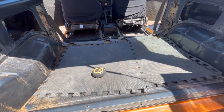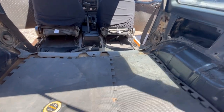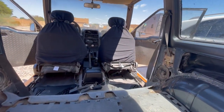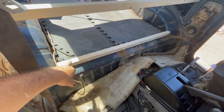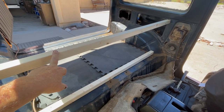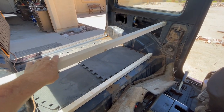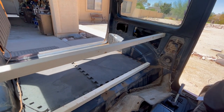To make our storage a little bit easier, the design idea is we're coming up to this level right here — about 15 inches in the back and 16 inches in the front. This bottom piece is 42 inches long, and this piece is 51 inches long — actually just a sixteenth short of 51, about 50 and 15 sixteenths. It's sitting in there right now, not mounted to anything, just squeezed in place. That's going to mark the front of the box.